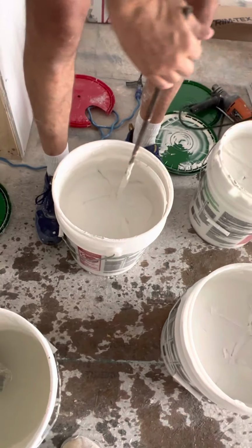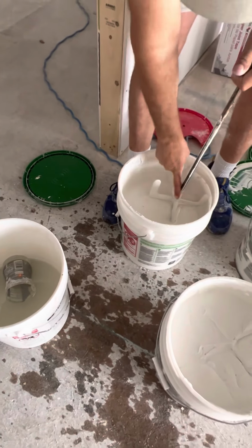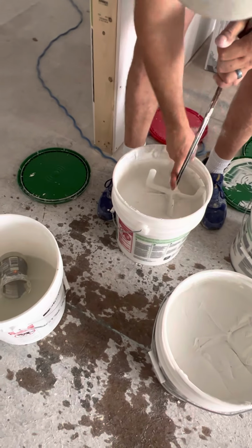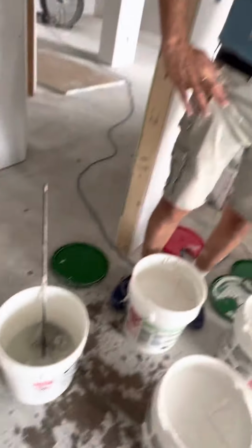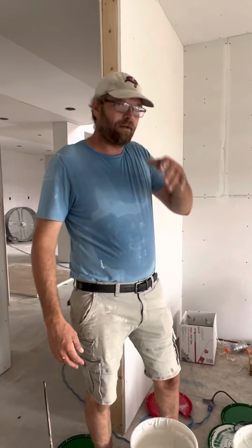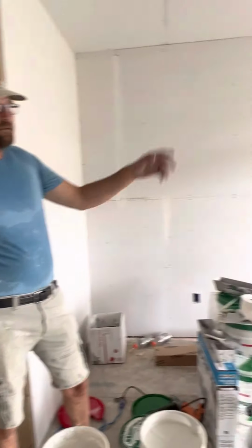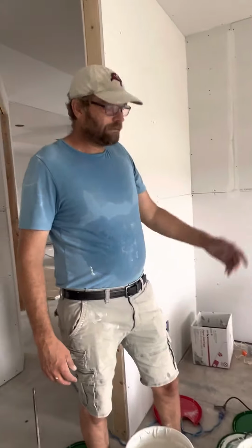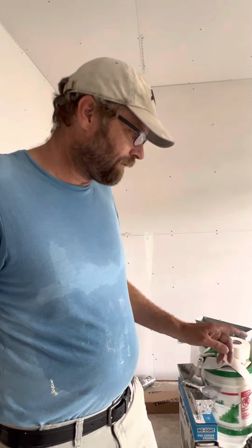Now, this morning, I replaced the razor on my tube, because the last, I don't know, I ran it 3 or 4 houses. And bigger houses. I don't really use the Bazooka unless the house is probably 15,000 feet. I'll hand tape most of them. The reason I'm using it in this, I like the glazed angles, and it makes it a lot easier to make speed.